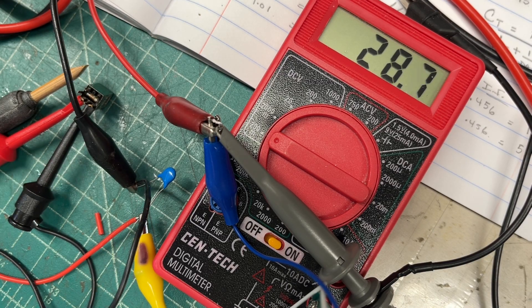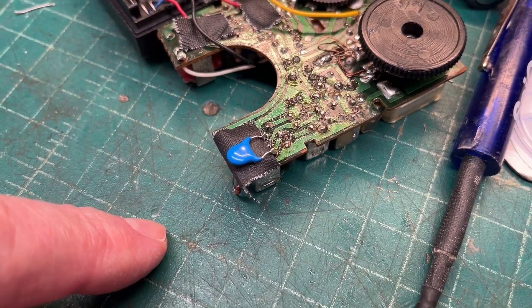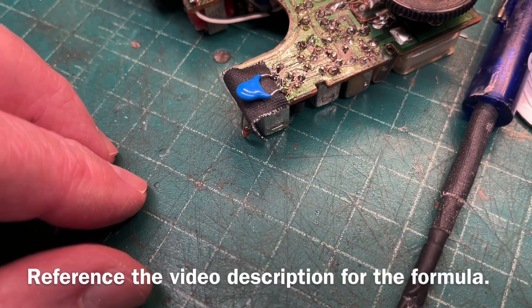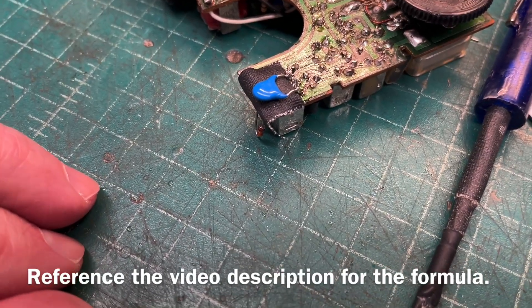I don't think I have a replacement transformer — I think I looked before. So what I'm going to do is put the transformer back in and see if I've got a capacitor somewhere in the 100 to 150 picofarad range that I can just solder in across the entire primary, then retest the receiver and see if it perks it up. Not a high-quality capacitor that I had on hand, but it's marked as 150 picofarads and reads around 137 picofarads. I'll pop up the formula — that should resonate with the inductor. We'll find out here in just a moment.